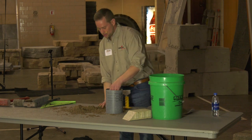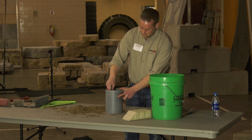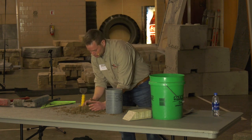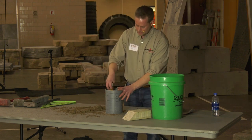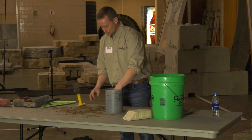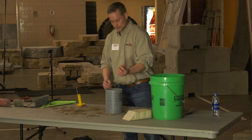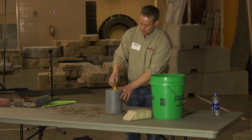We're going to introduce some geogrid in here and pack it in. I always tell my guys: right when you think you're done packing, go another 5 or 10 minutes. You just can't overdo compaction — you want to make sure you have proper compaction behind these walls. We'll introduce one more layer of grid and then cap this off. Same process: we're just filling up this cylinder with sand as we go up, compacting in lifts all the way up until we've reached top grade of the back of our wall.